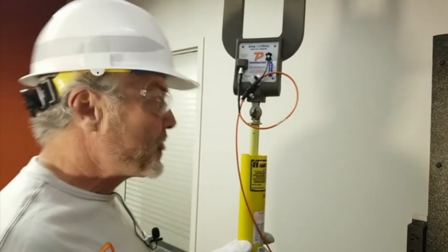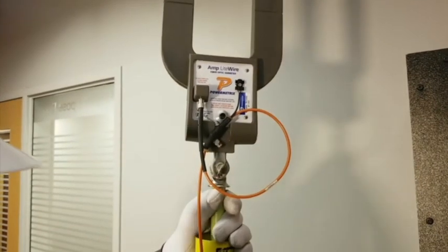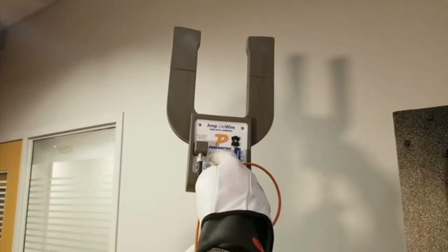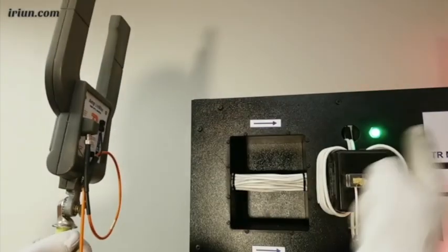Okay? Another thing, you always face the label. My P-brain, this is the way I keep track of stuff: label towards the load, the two L's. The label goes towards the load. In this case, you can see that my current's going this way, so I'm going to have my current this way, label towards the load.